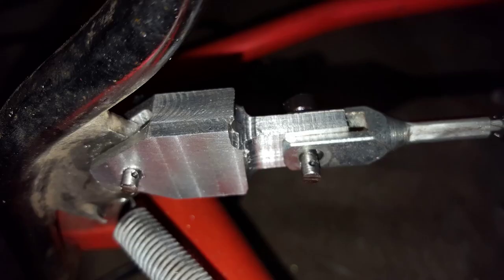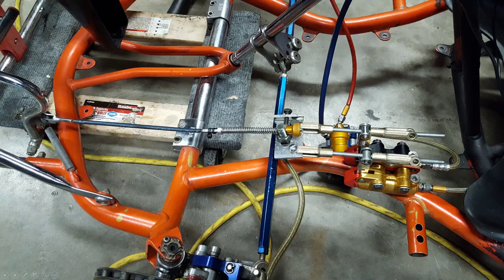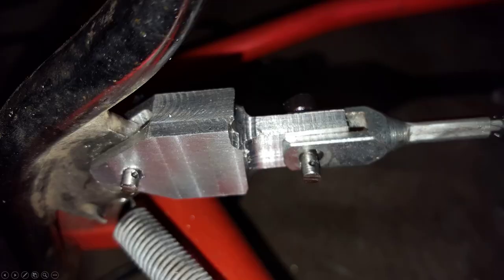Here is the small aluminum adapter I made to shift the brake biaser back a bit so it doesn't interfere — it just takes this and shifts it back. I made this with the Harbor Freight mill. You have the clevis going through here, which turns into a clevis right here, and this is the brake pedal. These little custom pins I made with the lathe and drilled through with the mill, and I put a paper clip here to lock them in place so they can't slide out.